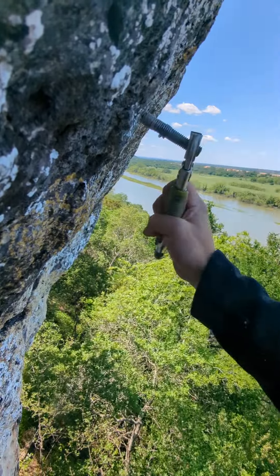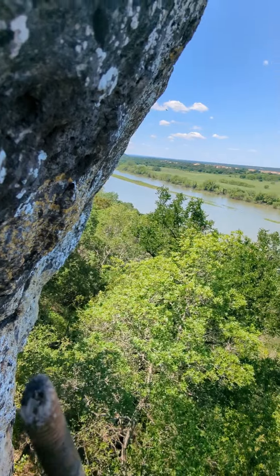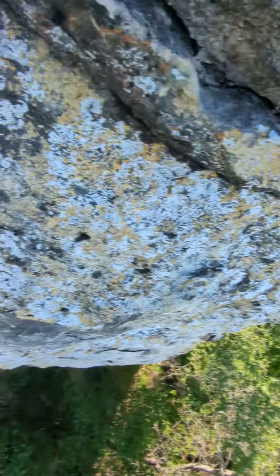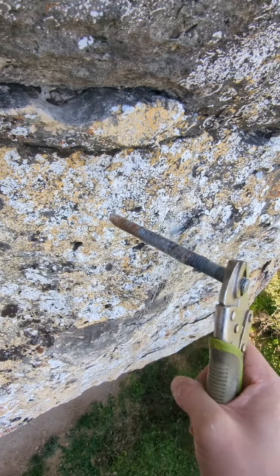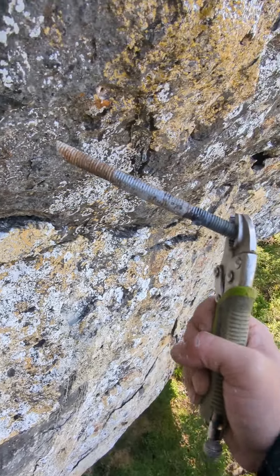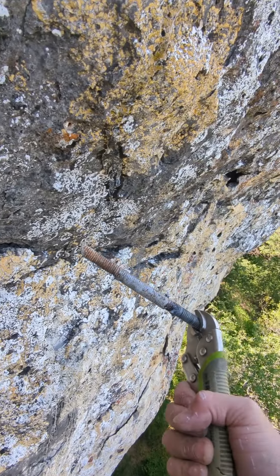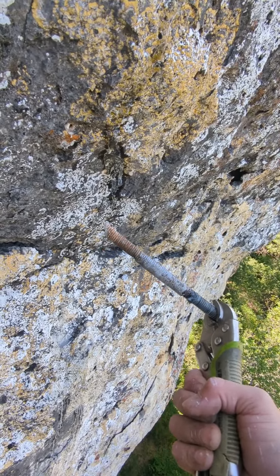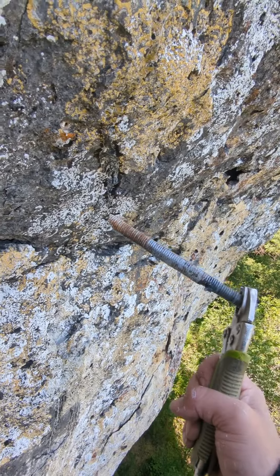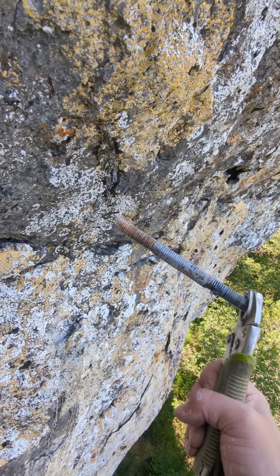It's unthreaded about an inch and a half from the rock, and there it comes out. Full zinc-plated threaded rod glued into the wall. Before the core drilling method, I do not know how you would have gotten that out that smoothly — that's definitely the right tool for the job. Luckily it wasn't longer; if it was another couple inches, I probably wouldn't have been able to wiggle it and drill it out. Maybe we'll need longer core drilling bits in the future, but 153 was long enough for this job. Thanks for watching.